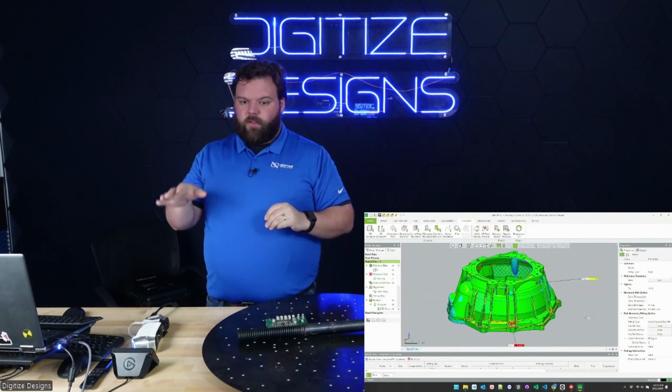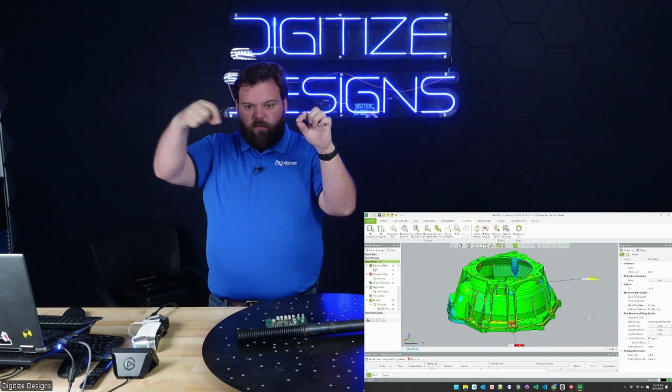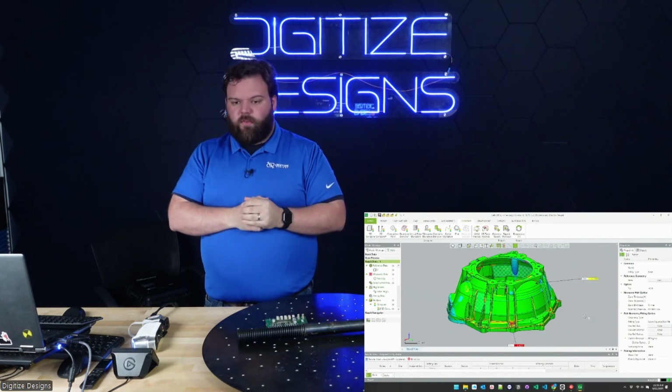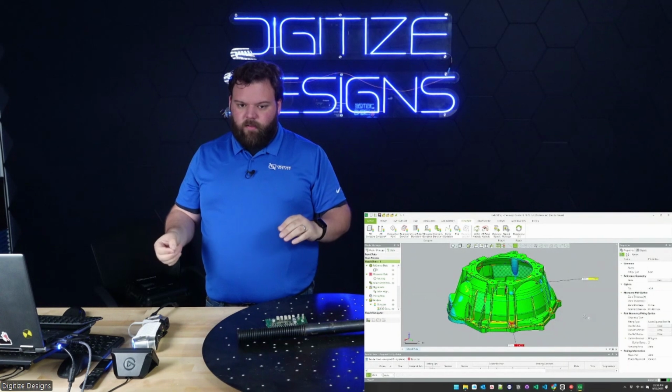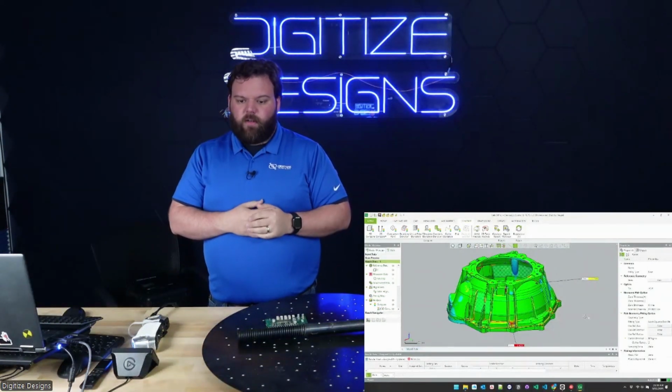But if you pulled it into software and checked the flatness, where it actually checks the heights of each of those points, like drags and checks that it's a perfectly flat plane, usually you'll see it's very flat. But it's a natural thing with any structured light laser scanners. You crank the resolution all the way up, it is going to get noisier.